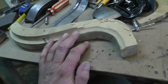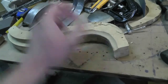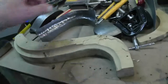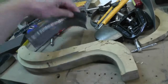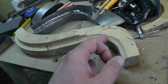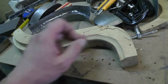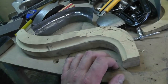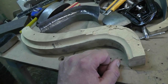I'll do that short piece first and prove I can get it done. If the longer piece proves to be problematic, I'll cheat a little bit — instead of trying to form the flange, I'll just form the recessed area. I won't try to form this part here, which is part of what makes it quite hard, and then I'll just weld it to the inner piece. It's a little bit of a cheat, but I don't think I have a problem with that.